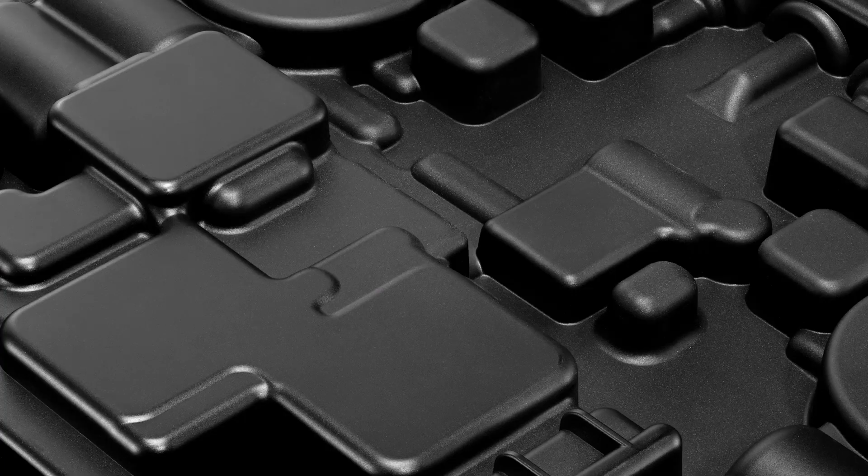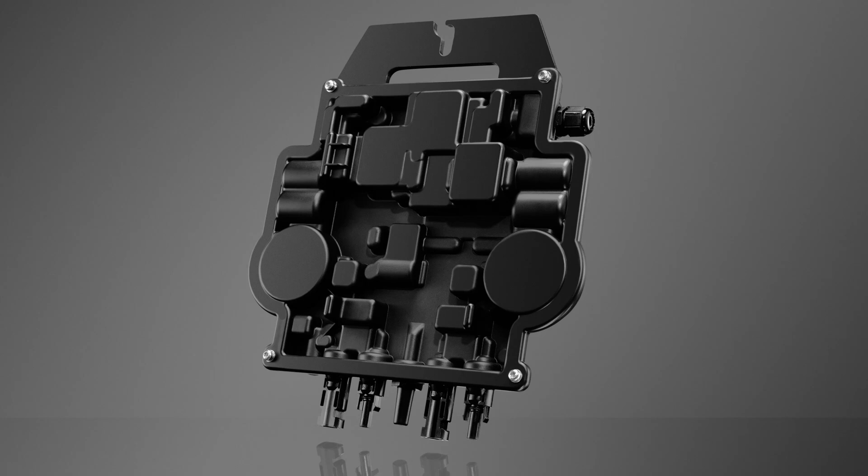You mentioned earlier the cooling topology — how much did that improve things versus before? We didn't want to add any fans. We wanted to increase capacity, but as soon as you add a fan that can fail, you're significantly reducing reliability and creating more issues in the field. So it all had to be convection cooled, just by air movement around the device. We've tried heat sinks in the past and other things. This new design allows for the maximum amount of ambient air cooling around those devices. Not only can they have these tremendous capacities of power output, but they can also handle high temperatures too.